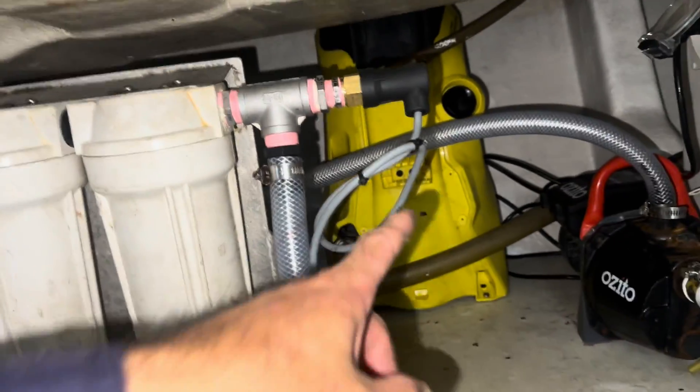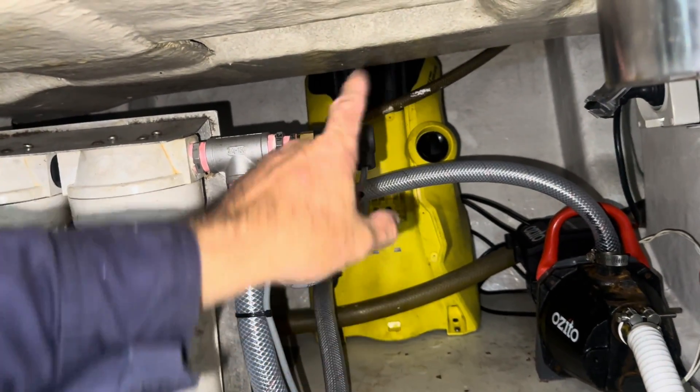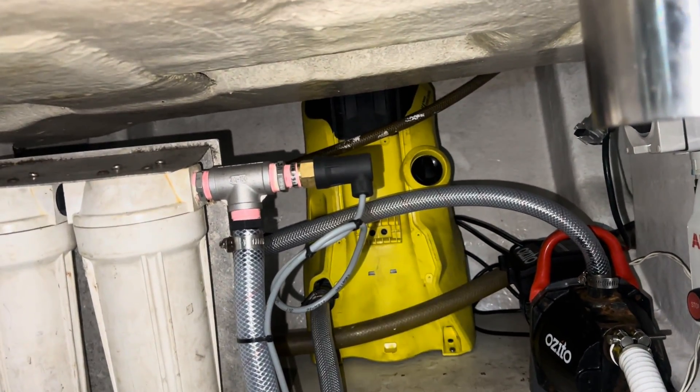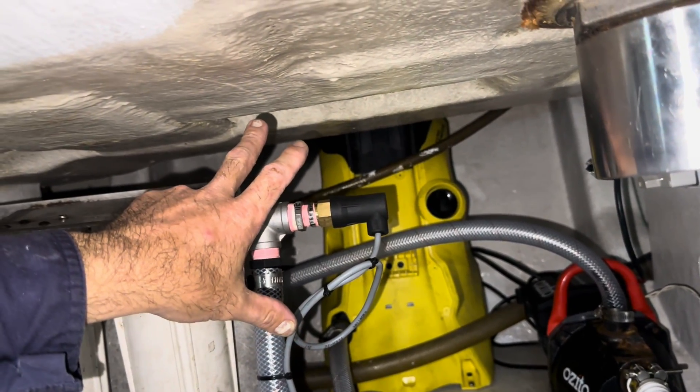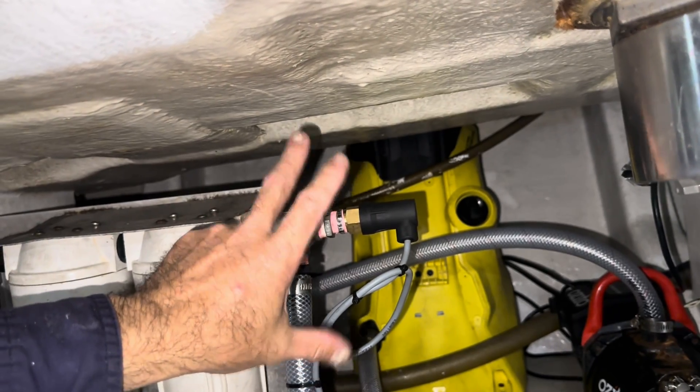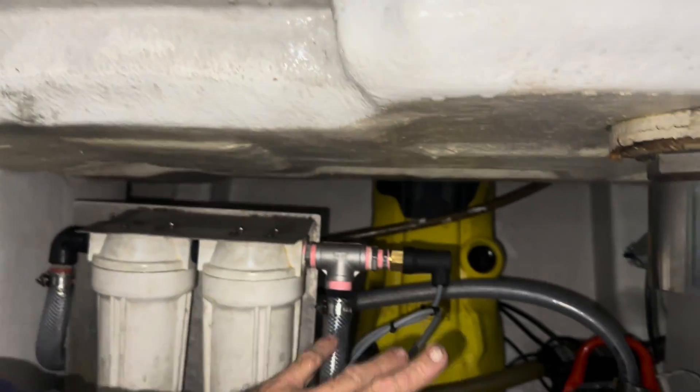This is actually a good example of using a Karcher pump — this is actually a K4. The reason why this is in here: they actually had a triplex nickel-plated pump and they destroyed it because of a dry run, since they had a basic system which was just on/off and that was it.